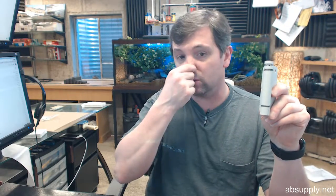I'm liking it to a tugboat. They don't go very fast, but they can pull a lot of weight. That torque idea is there when you've got more springs involved in the task, and you can share that load among those spring hinges as it's most effective to do so. So I like all spring hinges, because if you have a fire-rated door, and it's unlikely you do if you've got a 3.5-inch hinge, but if you did, your door has to be two things. It has to be self-closing and self-latching.